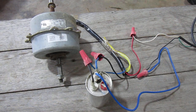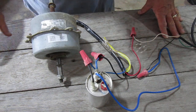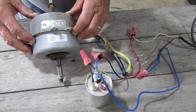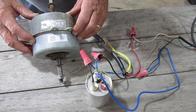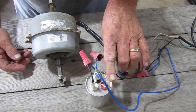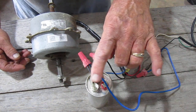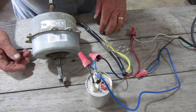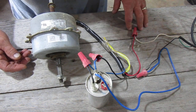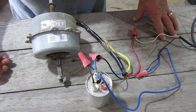Hello folks, welcome to my video. Today I've got a little project I'm working on and I needed a cheap inexpensive motor, so I went down to the salvage yard and I took this unit out with the capacitor. Before I go any further, I've discharged this capacitor with a screwdriver and I also took a diode to short it across the terminals to kill it so it has no power. Safety is very important when you're dealing with electricity — I'm no electrician by trade.